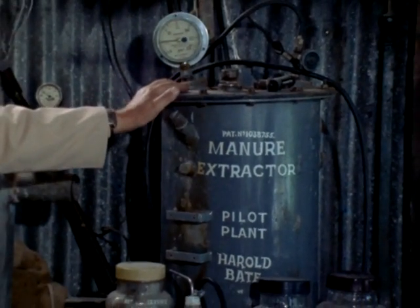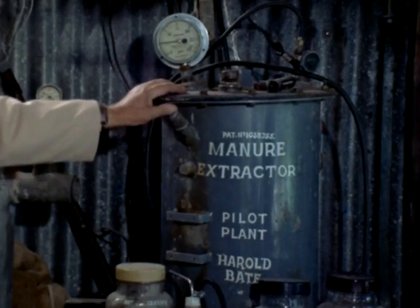The pig manure forms heat, and the poultry manure forms nitrogen, and the water forms hydrogen, and the straw forms carbon. All these ingredients together cause the bacteria in the manure to get to work. They first consume the oxygen from the water — this leaves hydrogen. And then other bacteria get to work on the hydrogen and form it into methane gas.